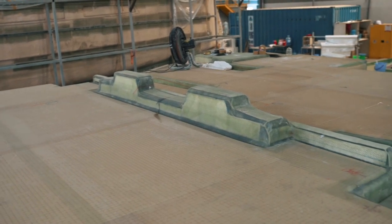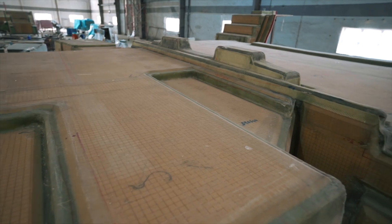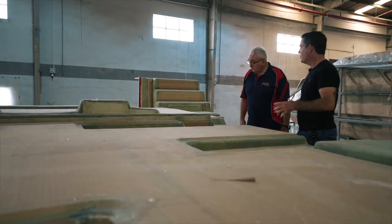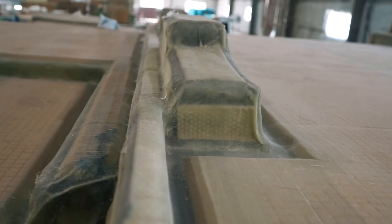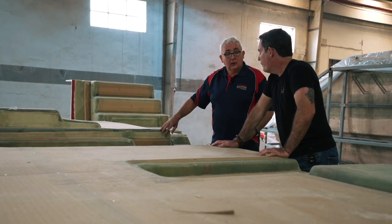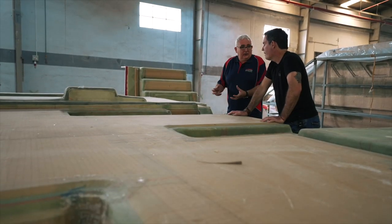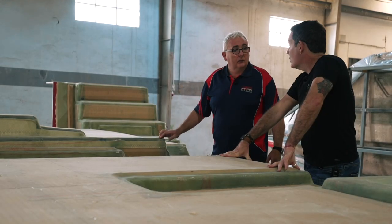This is the track for the trifold door, which also incorporates the gutter for cockpit draining and adds a lot of additional strength. A flat floor structure is very important or you're going to get a lot of stress. There's also a hexagonal foam core being used for certain parts — the hexagonal shape gives you a great ability to form complex shapes. This material is infusible, and the hexagonals form part of the flow path: the resin flows in along those channels. Without the hexagonals it would become like a big blanket, like normal core mat, which cannot be infused as the resin moves very slowly. The hexagonals give a path for air to evacuate and for resin to travel.